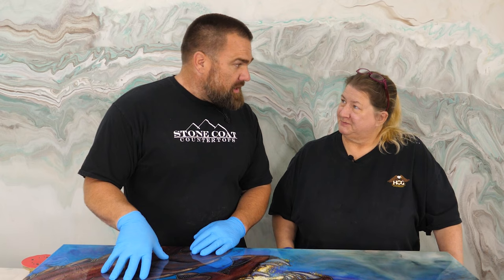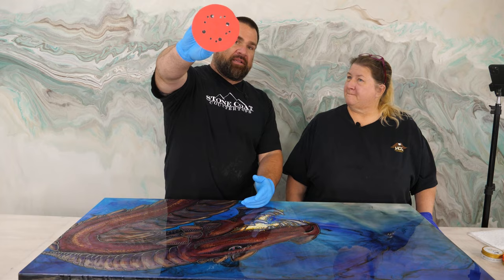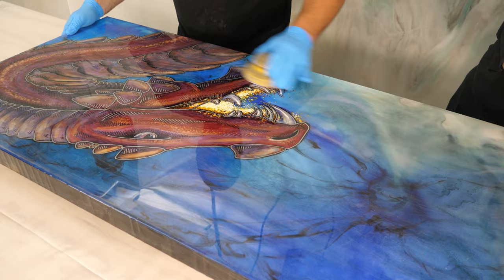So first step — it's been a couple of days since we did our clear coat. Whenever you have a coating of epoxy and you want to apply more epoxy, lightly sand with 220 grit, all sand, grab some alcohol. Don't worry that you're making it all scratchy — when we throw clear epoxy on this, all that's going to disappear. The epoxy is going to saturate in.